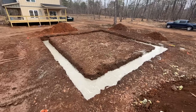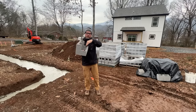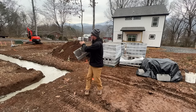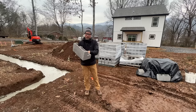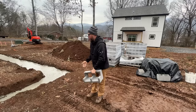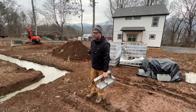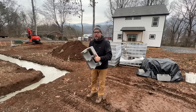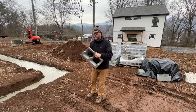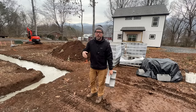That's a wrap for today. We got our footings poured, we've got our block on site. We're going to lay three courses of block plus one header block on top, and our slab will pour down in all these columns, in effect creating a giant header or beam on top of the footings and locking the wall into the slab - which is a really strong way to do it. We don't really do monolithic pours; I think we can do this faster if you can lay block. If you don't know how to lay block, doing the form work out of wood is probably better.